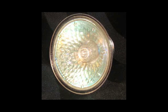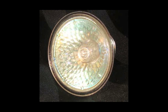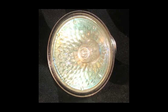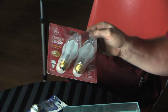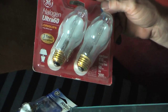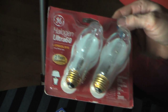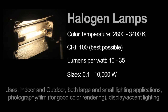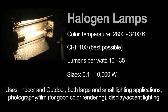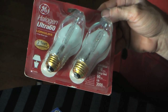Other single-ended lamps have an outer envelope, like this small floodlight bulb that screws directly into a socket — these are for track lighting and accent lighting in the home and in business. Single-ended bulbs for general lighting are coming out in different types now. With a BT-15 outer envelope, they fit a standard socket and are a great alternative to compact fluorescent bulbs. They're still considered energy-efficient, don't have the quirks that CFL bulbs do, have the same color quality as a standard incandescent, and are dimmable — which most CFLs aren't.